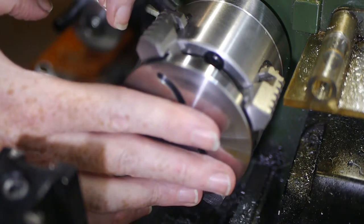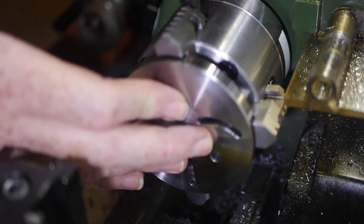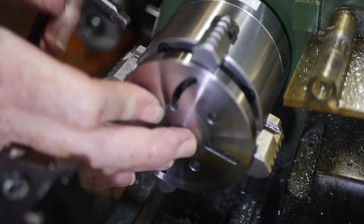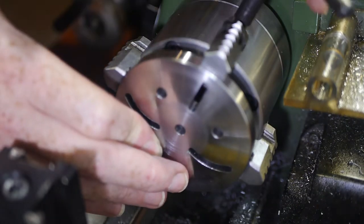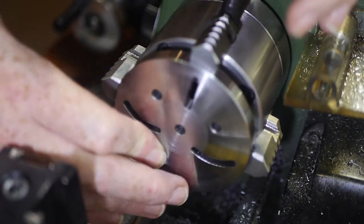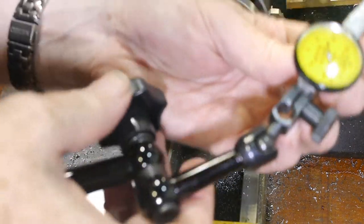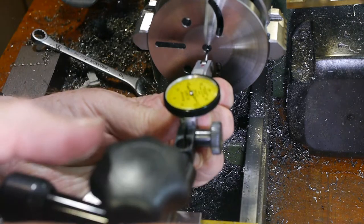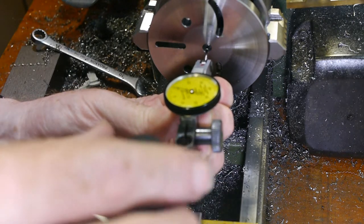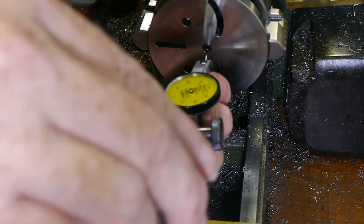I've chosen to mount the plate onto the spindle by cutting a pocket into the back exactly the diameter of the shaft. The inside diameter of the pocket provides the register to ensure the plate runs consistently true, and I use screws to hold the plate firmly in place on the shaft. The centre hole has been used as a reference for all the features on the plate so far, so it's a much better reference for the pocket than the outer diameter.